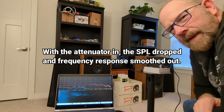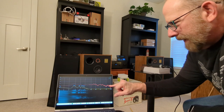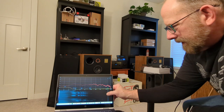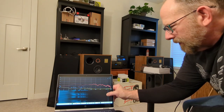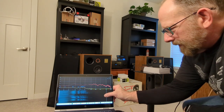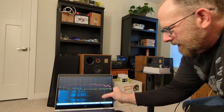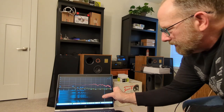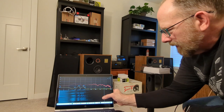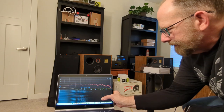I think I'm at the point of diminishing returns here. It came up, the level came up, and it's even back at baseline at, what is this, like 12,000 or so? Almost 13,000, which is right where, personally, my hearing disappears. We're down from 13,000 to 7,500 or so. Take a dip in here, from the crossover point on, it's fairly steady though.